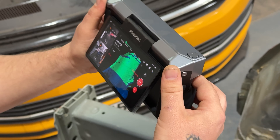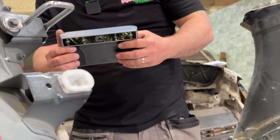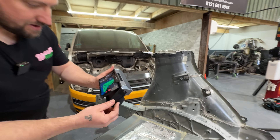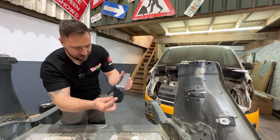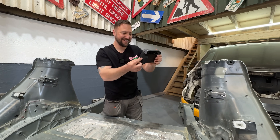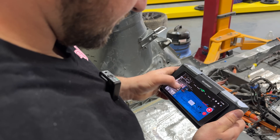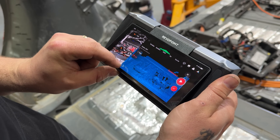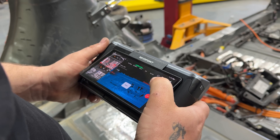As mentioned, this scanner doesn't need dots — it will do feature tracking. At the moment it's tracking over holes, bolts, any feature within the scan that it can reference as a point it's seen before. I'm not very good at talking and scanning because I'm trying to concentrate. I don't want to mess it up and have to do it again. See how it's lost its tracking there — I can just press back here, and then we can go back to scan, and it finds itself again.